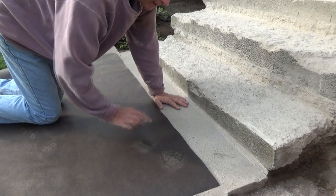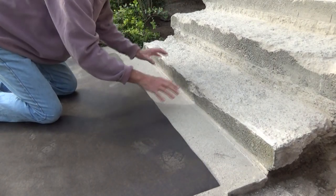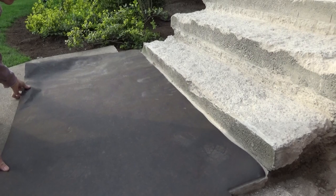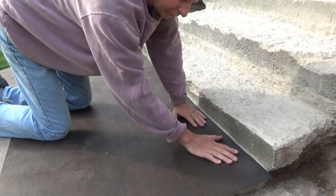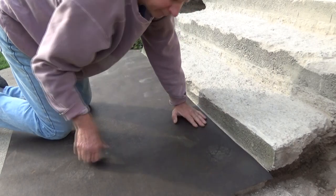This is the sidewalk — you see this little crack that goes across. I got to lay brick down here to put my stone on, so I'm going to put this little piece of black paper right up there so it's not holding on here. If the sidewalk goes back and forth, it's going to slide on the paper and it won't leave that crack.